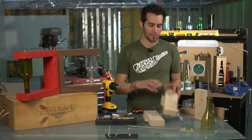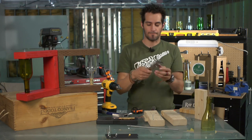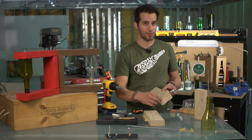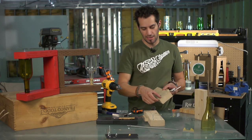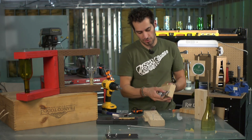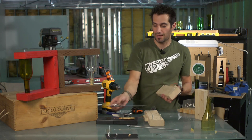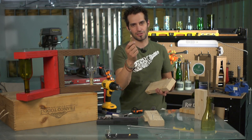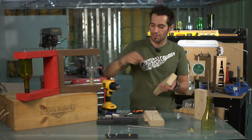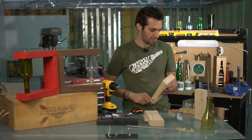The next thing you're going to want to do is mark your pieces of wood for where you want to drill — this is where we get into our cool tool: calipers. I measured 750 thou, which is nerd speak for three quarters of an inch, on this side and here. The way you use these to speed the process and be more precise is to run this along the edge, make a scratch line here, run this along the edge here and here, and it will form crosshairs for you. Then you take this cool tool — a spring-loaded center punch — and right where the crosshairs are you press it down, it clicks, and forms an indentation where you can take your drill or drill press and drill a hole straight through. We'll detail what size the drill bit is also.